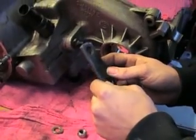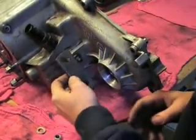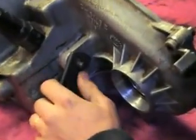Push on it gently, get it going in there. Urethane bushing next — this goes on, and I should just be able to work that down in there with my thumbnail. Maybe grab a small pick to help push on it just a little bit. There it goes — now I can feel it pushing in there. A bunch of little small parts. We've got this piece seated in fully. Now this component goes on — this actuates your shift range selector from your lever inside your car. Very important how it's oriented. See, it's slotted — goes on right there, just like that. Numbers on the outside of the case facing this way.